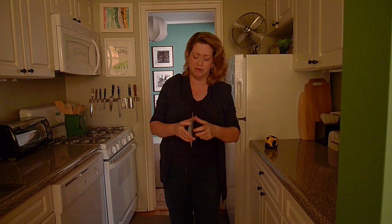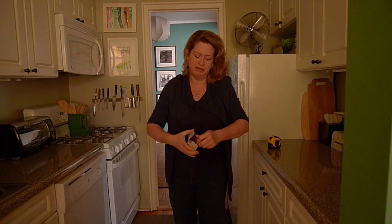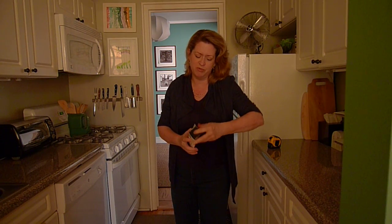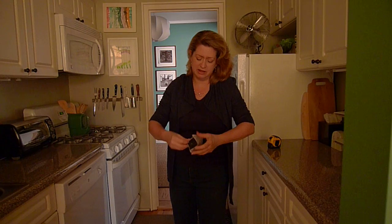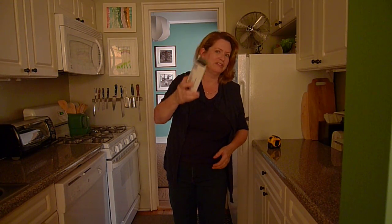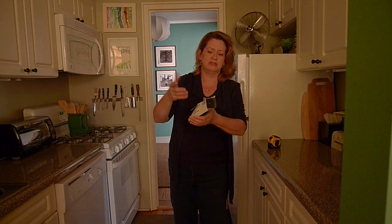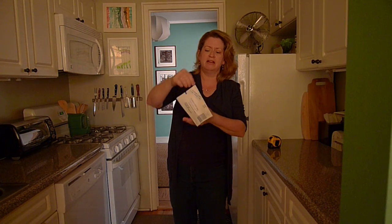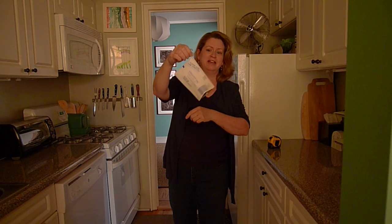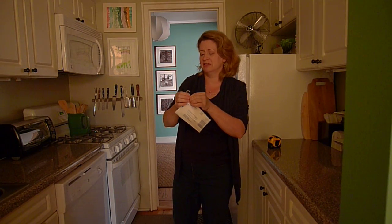All you do is take this piece of foam and you open this envelope into a squarish shape, and you stick this inside here. All the foam is doing is keeping the envelope open so that it can absorb the air and test the radon. The activated charcoal inside, hear it? That's what is actually going to be used to test the radon. And on the other end of the envelope is a little hook that you can use to hang up the test.